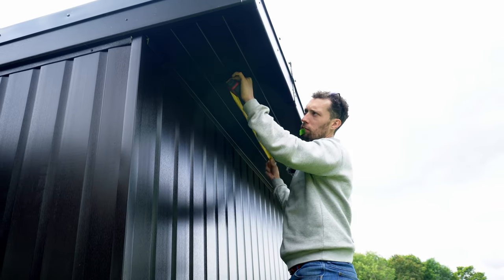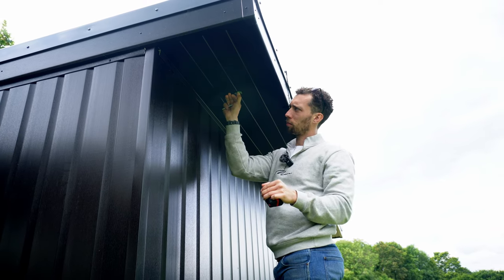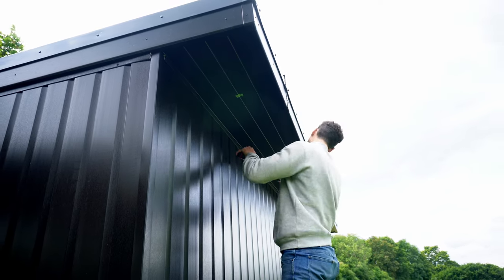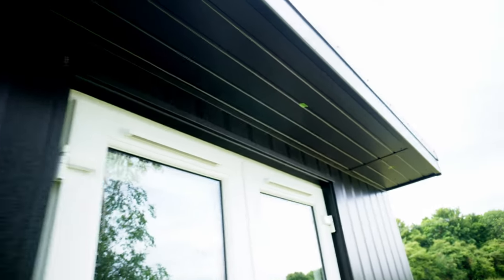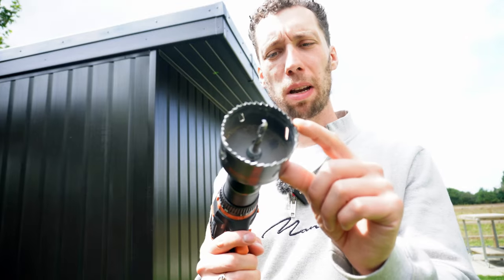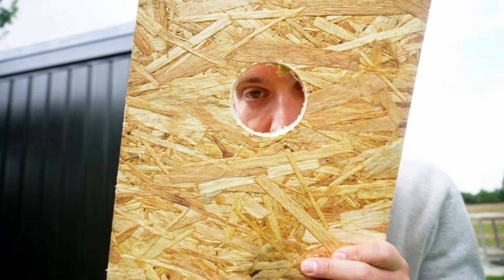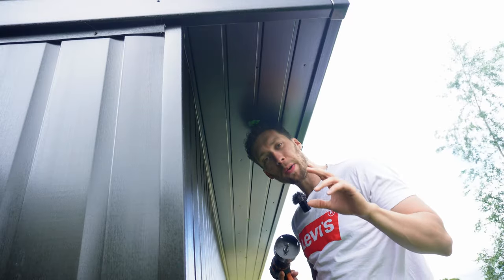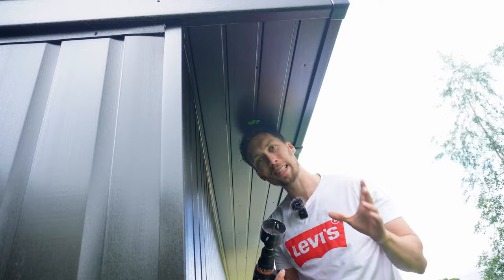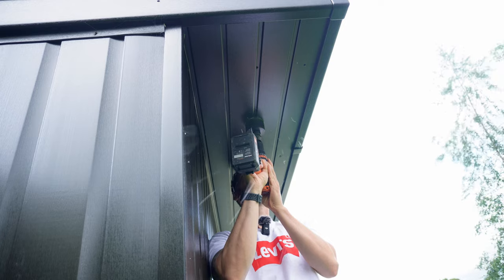With all of my sockets prepared for insulation and plasterboarding, I could now move on to the lights. Starting off, I decided to put five downlights in the overhang on the front of the workshop. For each downlight I've put a little bit of green masking tape where I want to drill the hole. I'm using a 73mm hole saw bit, which I've tested on an offcut of OSB to make sure the lights fit. I always find stuff like this really nerve-wracking because any slight mistake means redoing an awful lot of work.